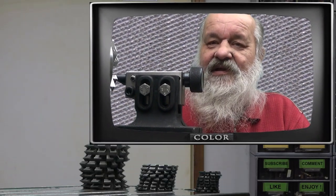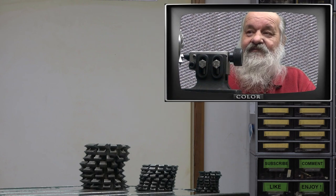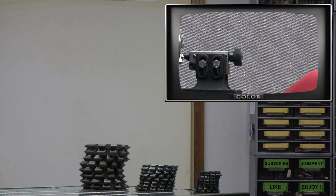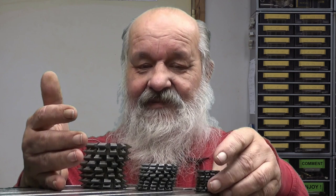Next will be gear specific. It will be the module gear cutters, and that will be some theory. Well, gear cutters, involute gear cutters. Here you have three sets of them. These cutters always come in sets of 8. Well, there is a reason for that.